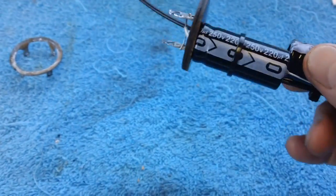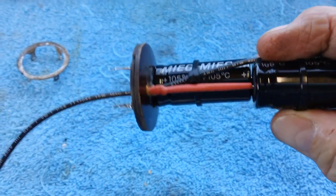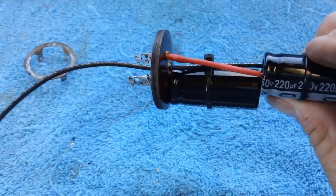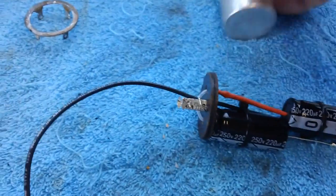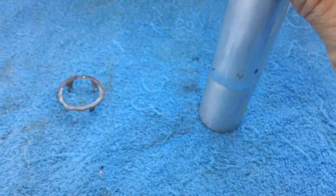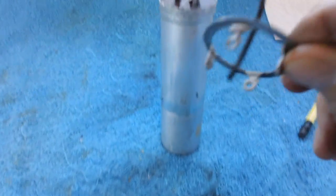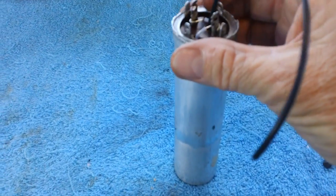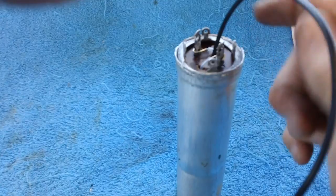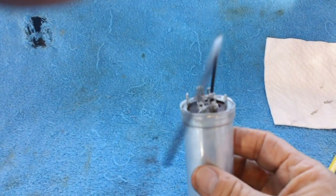That leaves the holes free to hook up all the wires and everything is nice and solid now - no wiggling around at the contacts. You can take some hot glue and put it around there if you want - I try not to use hot glue very much anymore. The way this thing goes in is right down in here like so, just like that, and then this ring will go back on here. I'll position it away from the leads, then crimp over the edge all the way around. Then we'll have our cap completely restuffed and can put it back in the chassis.